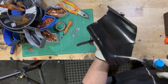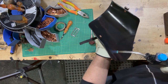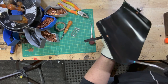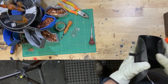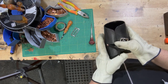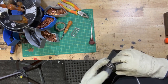As you heat it, the plastic takes on a bit of a sheen, and a sheen is fine. What you don't want is for it to get very very shiny, because that means you've liquefied it and that's gone too far. This feels pretty close to done — it's really rubbery, you've got all kinds of flex and twist. If your plastic is smoking, you've gone too far.